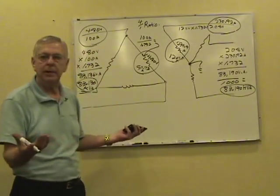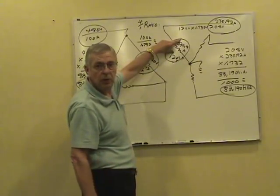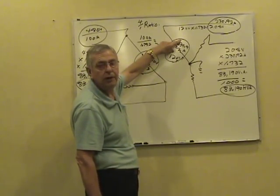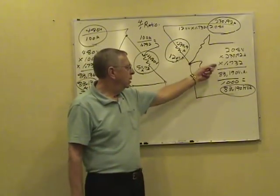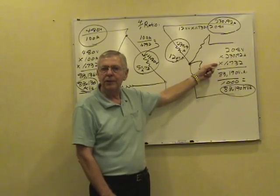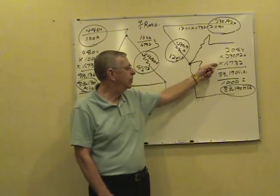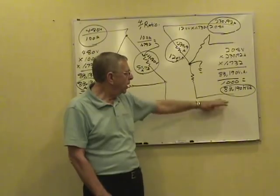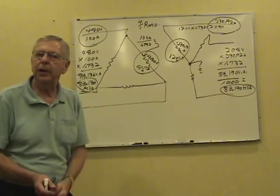It's approximately 83. You could work it per phase, you could work it single phase: 120 times 230.9 times 3. I don't like to do that. You know why? It gets you out of the habit of using 1.732 for the total three-phase load, which is by far the biggest mistake made on three-phase transformer problems, forgetting to use it. Okay, on this particular transformer, we got a load a little more than 83 kVA.